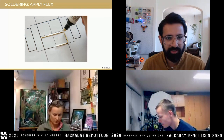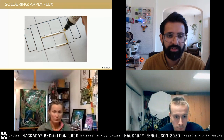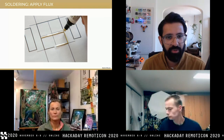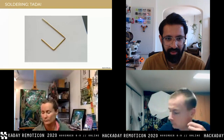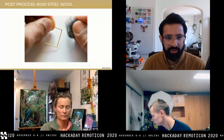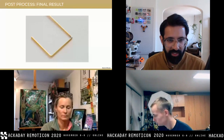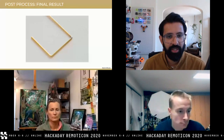Next step: solder. Soldering is pretty straightforward. I keep my soldering iron around 700 degrees. Depending on the gauge of brass and the material, you might want to adjust that temperature. Once you form the solder joint, you'll see a little bit of discoloration from applying heat. This is a common problem but has a very easy solution: use a fine-grade steel wool and just brush it off — it will result in a very clean matte-looking solder. Try doing this with every solder joint if the area is accessible. You don't want to be applying the wool after the sculpture is done.